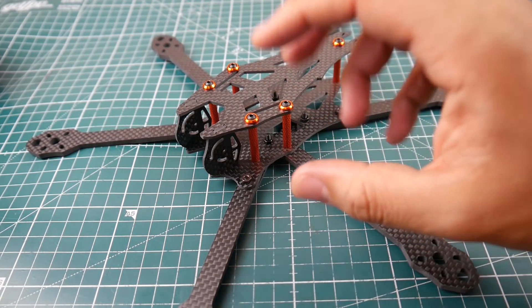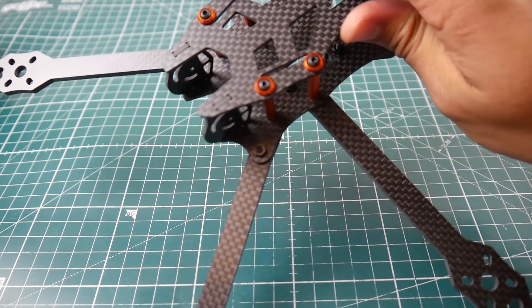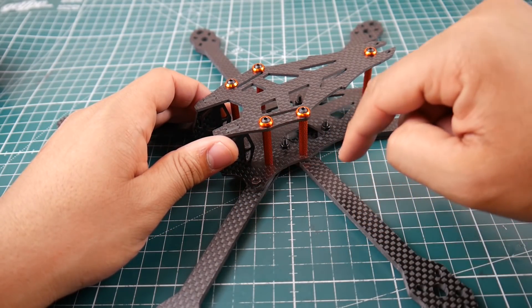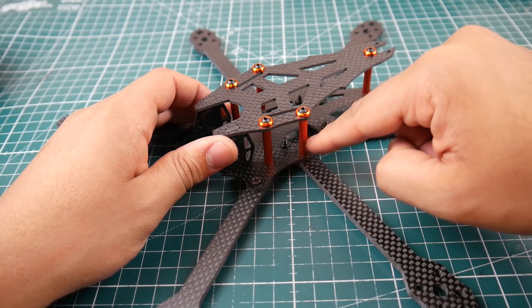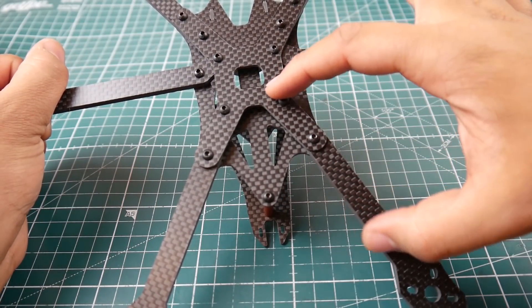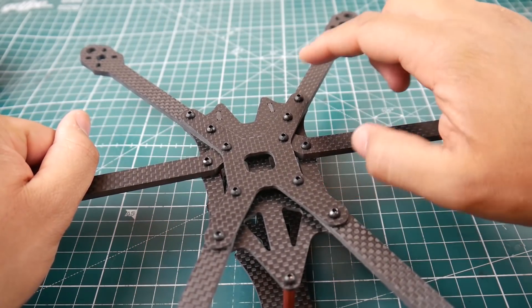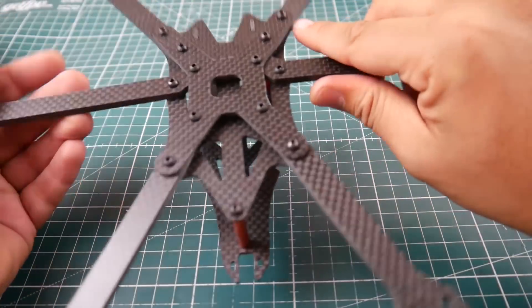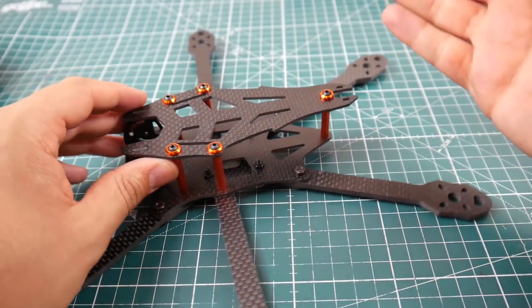The hardware itself is pretty good. However, the nuts they're using are not self-locking — they don't grab into the frame and they don't have the nylon piece inside; they're just basic normal nuts. Each arm is held with two screws, and the arms interlock — the front arm's screws also help hold the adjacent arm, with those going into the standoff.